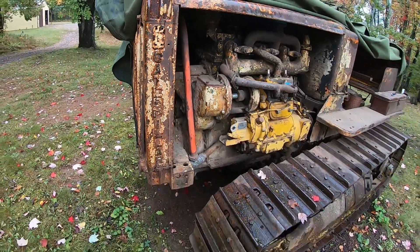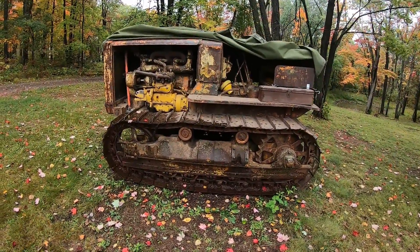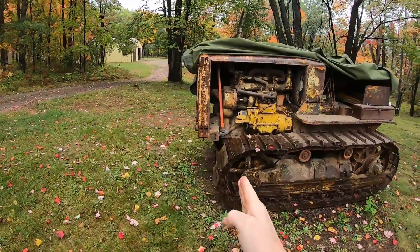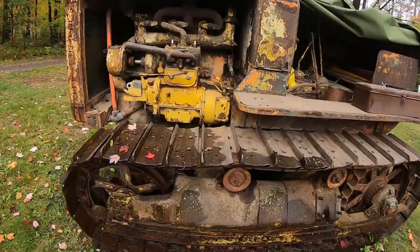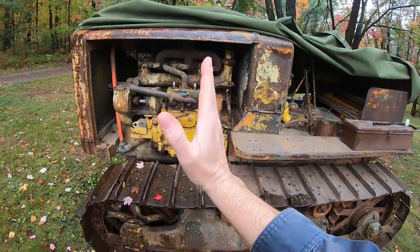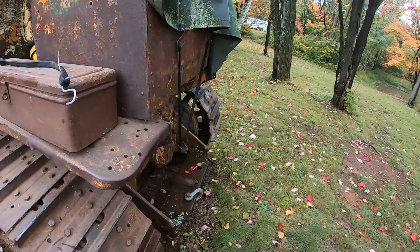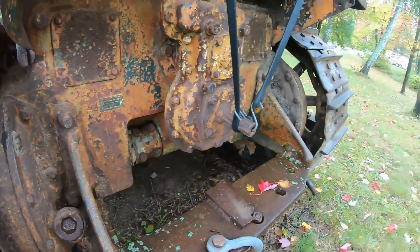And out here one final time to the old narrow RD6 to illustrate why this chassis was much better suited to drawbar pulling than it was to dozing. Look at the spacing of everything — you see how the engine sticks out further than the front of the tracks. We've got the main leaf spring that holds the front of the tractor up that runs down in here, about this area right here. So the majority of that engine weight is in front of your suspension point. And you look at the back end — of course it's going to be a bit lighter than the engine.